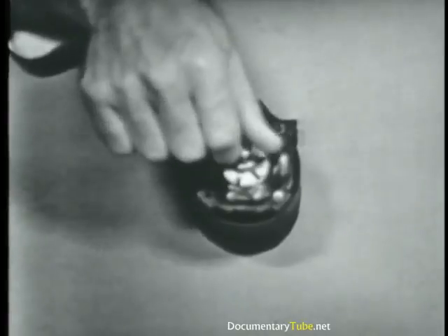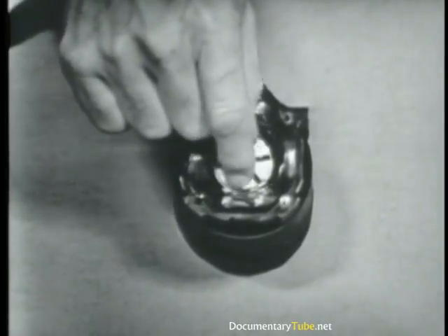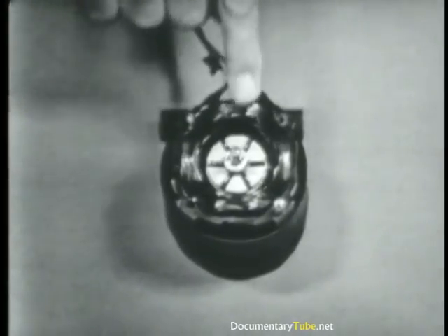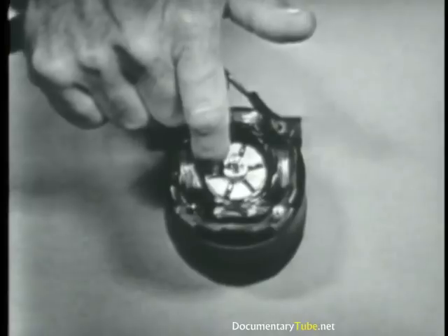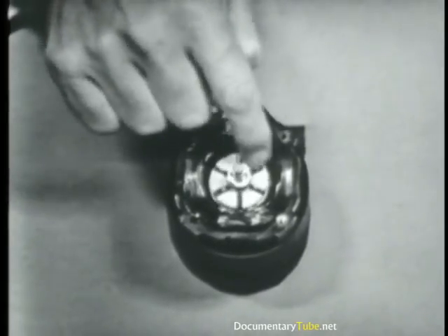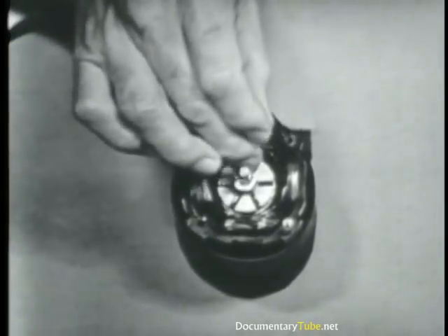But how much slower? Well, that depends on two things — the amount of internal loading and the amount of external loading. Internal loading refers to the drag or the load on the motor caused by weight and friction — it takes a certain amount of energy to overcome the weight of this hunk of iron to cause it to turn, and the friction of the rotor shaft on the bearings adds to the internal load. There's also a little cooling fan built into the rotor that increases the internal load. Now, the external load refers to the job or the work that the rotor must do — that is, turn gears, operate pulleys, or maybe turn a fan blade.